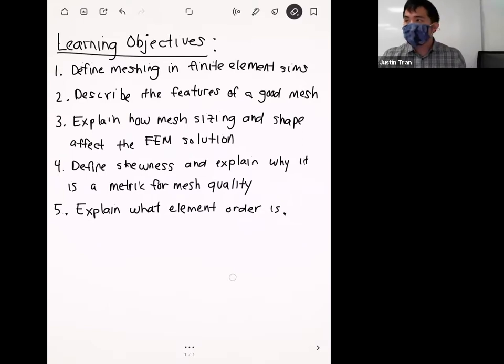What do you mean by isotropic material? No matter which way you load it, you're going to experience the same stresses because the metal is basically homogeneous. No matter which way you cut the metal, it's going to behave the same because of how densely packed it is. Okay, I see. But it's different from wood. Wood has fibers that run through it. So if you load the wood in the fiber direction, it's going to be stronger than if you load it perpendicular to it. Right, that's what's called an anisotropic material. It's like cutting a steak across the fibers. Exactly, the fibers make a difference in how it behaves as a material.